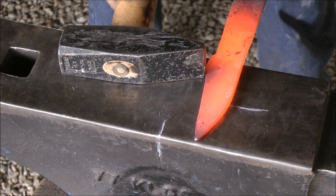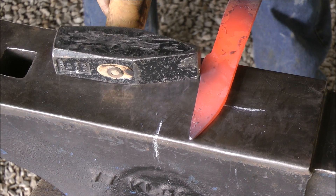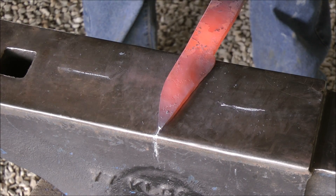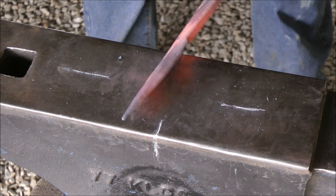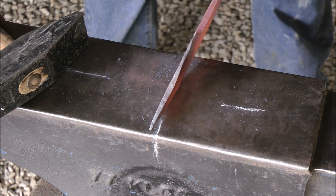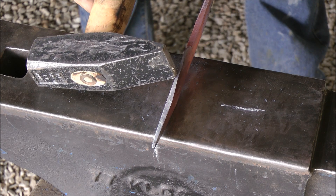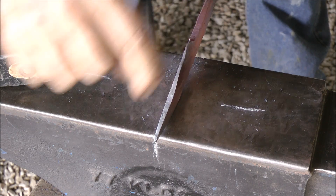Now look at where I'm hammering — right there. Put it on the side, flip it over, same thing on the other side. Moving on to my next section of my blade and then hammering that. As you can see, the edge thickness is not consistent. So I'm going to start back here on the next run, get my edge to where I'm currently hammering at the same consistency, and then moving on.